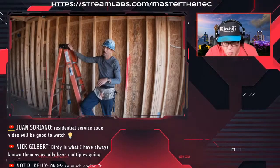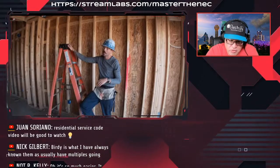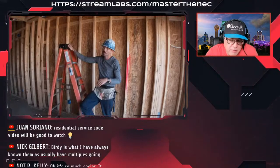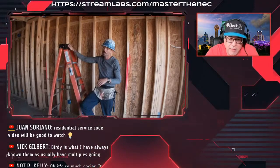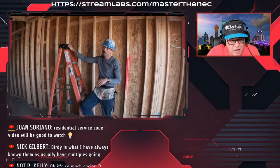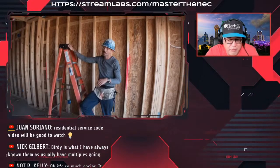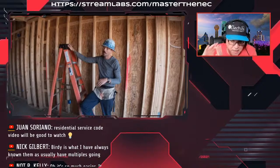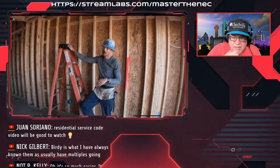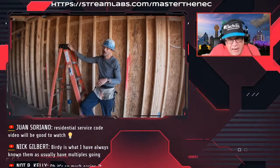Now, if it runs through studs like the wall that's behind him, then it's considered secured and supported as it runs horizontally through those studs. If you run vertically, parallel with that stud, you're still going to meet the 4.5 foot securement requirement. And typically, you're going to secure that NM-B within 12 inches of a box if the box has a clamp. If it doesn't have a clamp and it's a 2.25 by 4 inch box, a simple Carlon nail-up box where you simply knock the knockout out, then you're going to want to follow the rules in 314.17, I believe. That's where it says you have to put a securement within 8 inches because there's no clamp at the box.